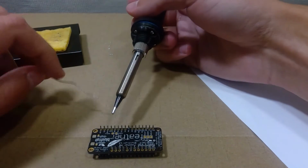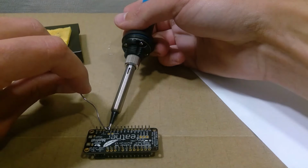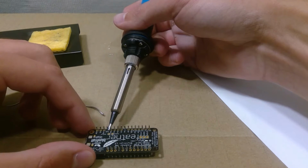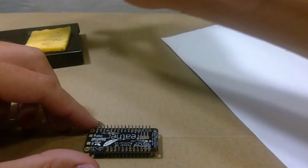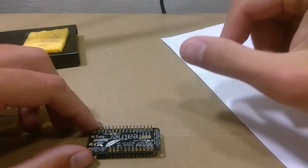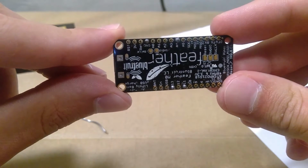Okay. Set it for a bit. We'll wait a couple seconds and we'll try. Just give it a little bit more time than you did the other ones. Okay. And when you're soldering, you want to stay steady. You don't want to tap, tap, tap, because it won't let the whole metal around it get up to temperature. Let's see how I did. Go to ground. Okay, the whole gold circle is covered.